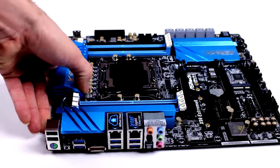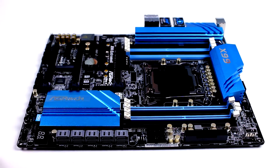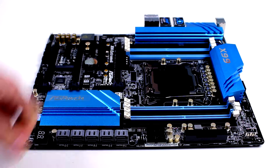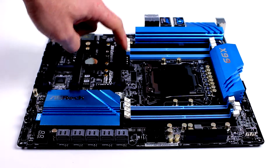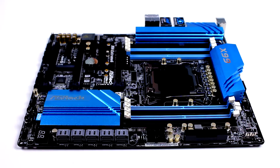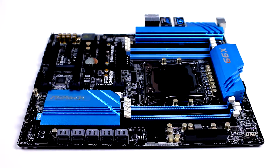And that is essentially it. Of course you have your Socket 2011 V3 socket for your CPU — pretty standard. Next to that you've got another fan connector, as well as a Molex connector for power. This is for supplying additional power to the PCIe bus should you need to do that — probably don't need to unless you're doing multiple video card setups. But it's there should you end up needing it.